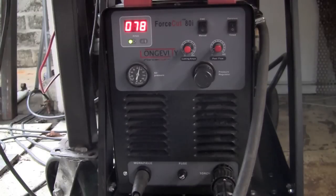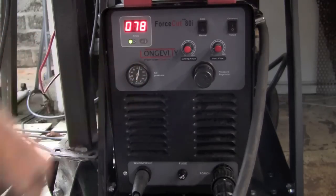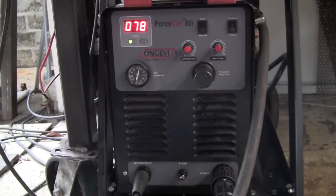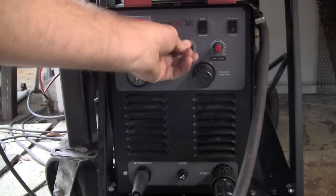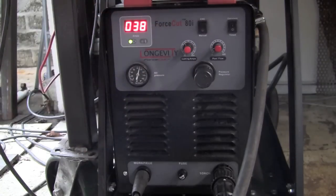A lot of people try to make plasma very complicated. Right now we're just going to shear a piece of 18 gauge. Two things I want to deal with: I want to make sure I have air pressure — I've got about 90 pounds dialed in, close enough. 78 amps is a lot to be blowing through 18 gauge, so I'll turn that down to about 40 amps. I'll dial in 38 — that's good. Now we'll go up to the piece and do a cut.